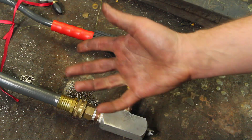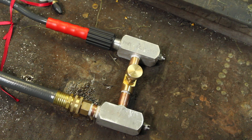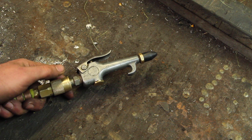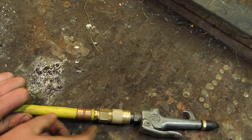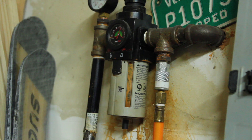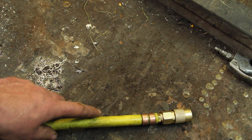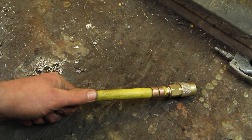Then we have pressurized air through a garden hose. Why a garden hose? This is a good jumping-off point to talk about some of the thermodynamics involved here. When you compress air it heats up in the compressor, and then when it gets into the tank and into the air lines it cools down. When that happens, as most people with shop air systems know, water condenses out of it, which is why you end up needing water traps and that sort of thing on your system.